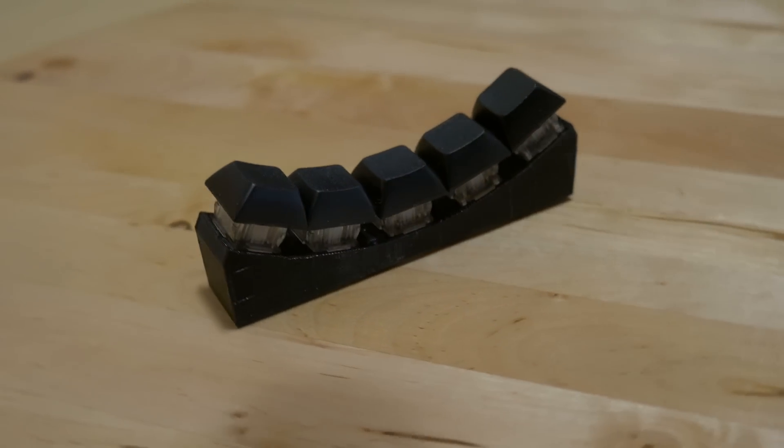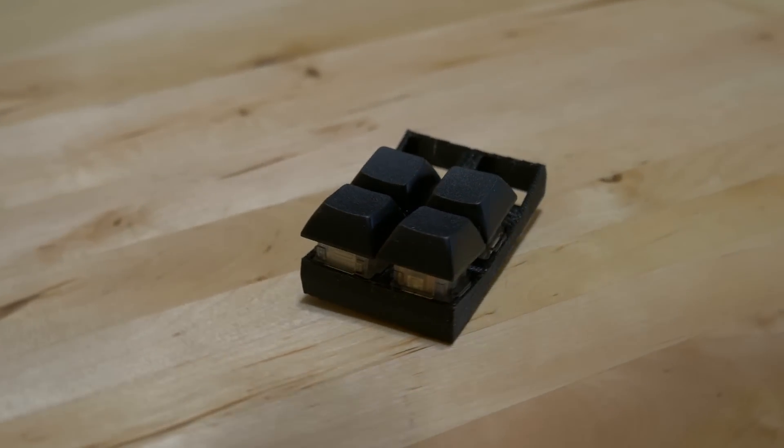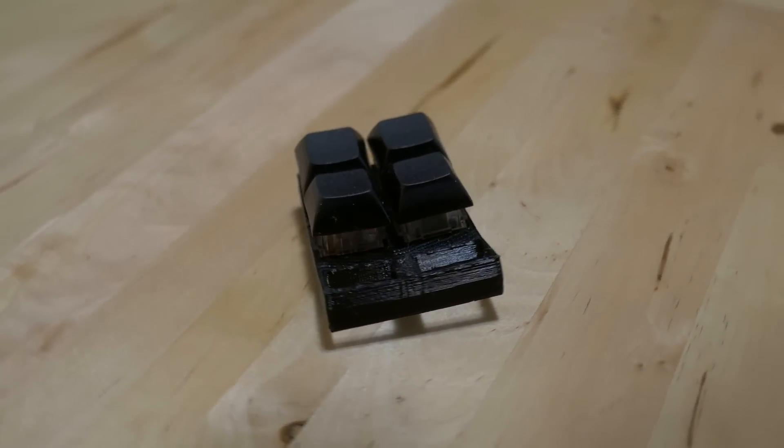To fix the key spacing issue I made a prototype model, put the switches in, and looked at all the spacing between the keys. The first version — while they didn't hang on each other, which was a great improvement — they weren't evenly spaced. The reason is that ALPS keys sit a little bit higher than Cherry keys, so I didn't take that into account. In my second version all of them are evenly spaced and it looks perfect. For my final spacing prototype I made a piece that has both a column and a row next to each other so I could check spacing in both directions.